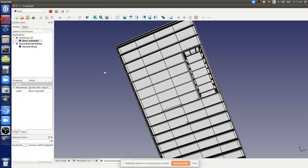The advantage of cutting it in place is that it's easy. You don't have to measure anything because you know where you are. The disadvantage is it's a little harder physically. Conceptually, it's very simple because you've got a 4-foot aperture there, but physically, it's a little harder. With a Sawzall, it's really hard to get really accurate cuts. You have a pretty ragged looking hole. But there's a plate that goes on the end of that, so that gets all covered up. I don't think that's too much of an issue.